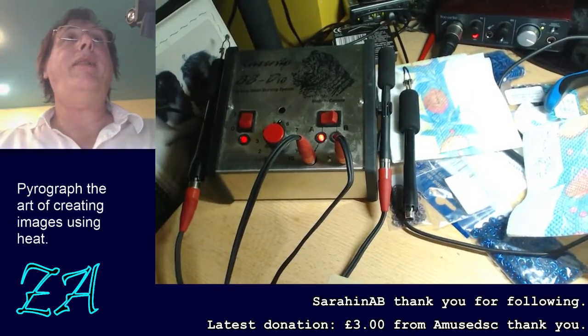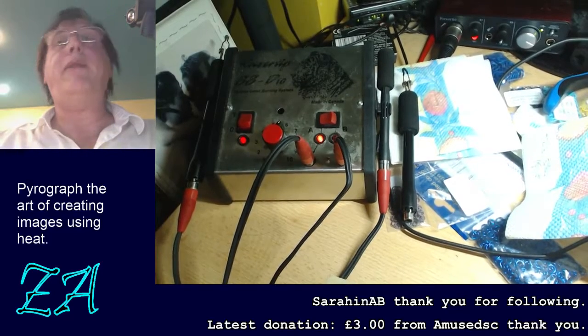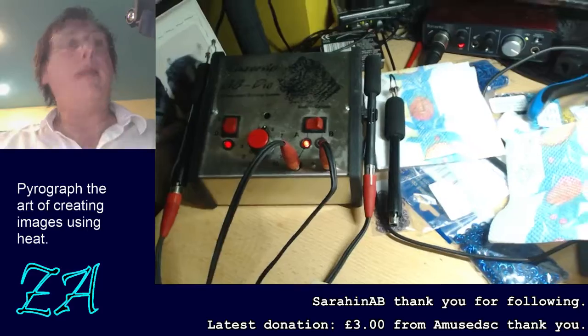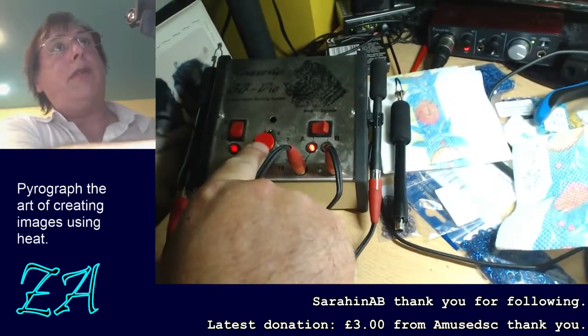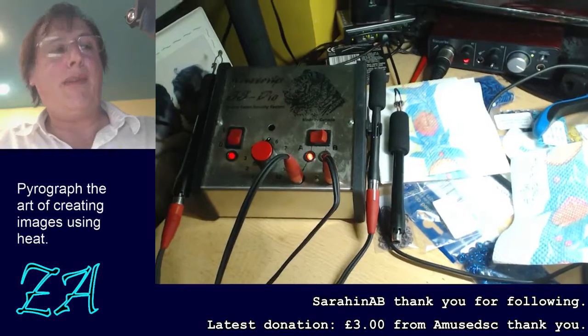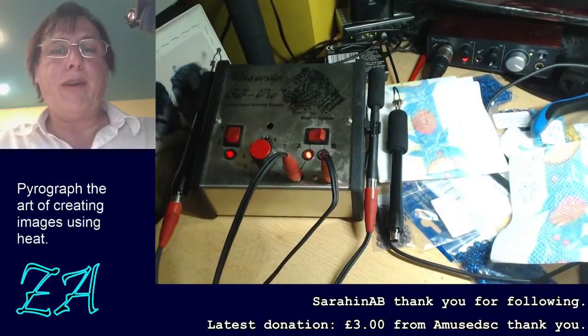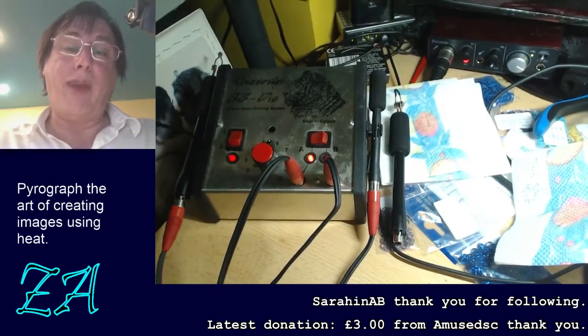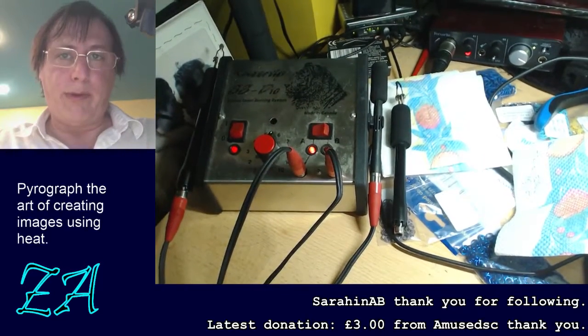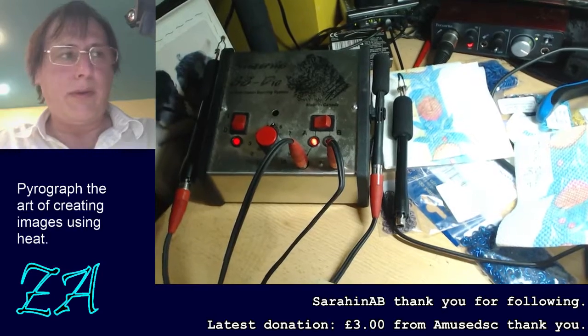Essentially, all that is a mains to low voltage converter with a control on there, which has the effect, it's not controlling the temperature, but it has the effect of varying the temperature. So what it's actually doing is controlling the amount of current that gets sent to the tool.